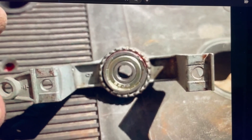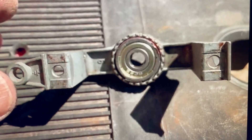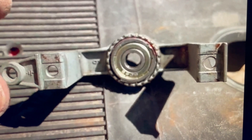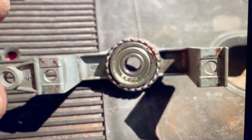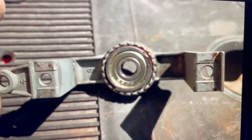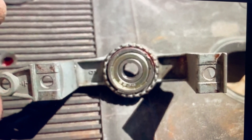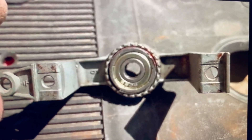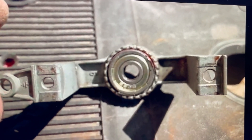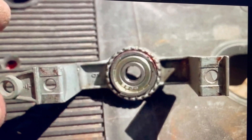In this example I've got that shim going around exactly 360 degrees, the circumference of the bearing boss. But in your application you may need to adjust the length of that shim — it may not need to be the entire 360 degrees. If you make it that big the bearing may not fit; it may be too much thickness. So adjust the shim length to get the bearing to be a nice firm fit so that you can just barely push it in with your fingers. That'll keep the outer race steady so the outer race won't spin inside the boss.